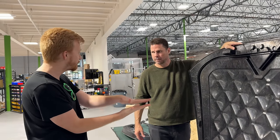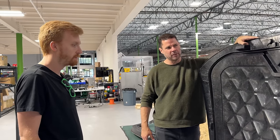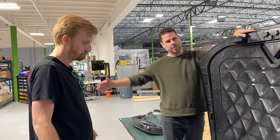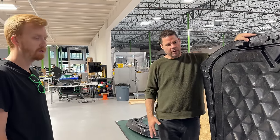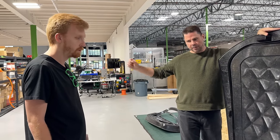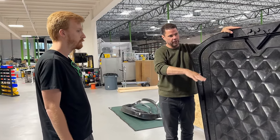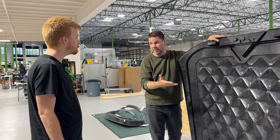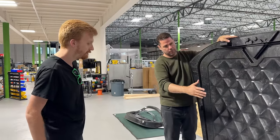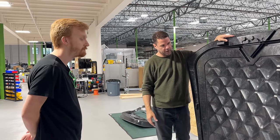How long does it take to produce this piece? The smaller the piece the quicker the stamping — the real small pieces are like four minutes. This one is probably more like six minutes, and the big pieces are like eight to twelve minutes because the material has to heat up. You keep the material hot, then transfer it into the die, it cools down a little, press the dies together — as it presses and squeezes out it takes time to flow. So the big parts like the tub take the longest. The upper A-pillar stuff is super quick.